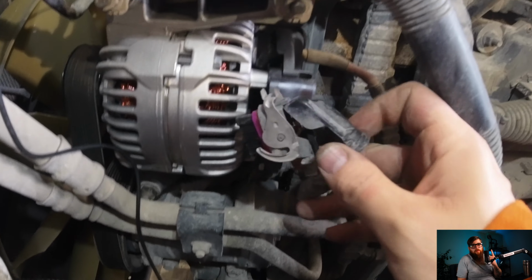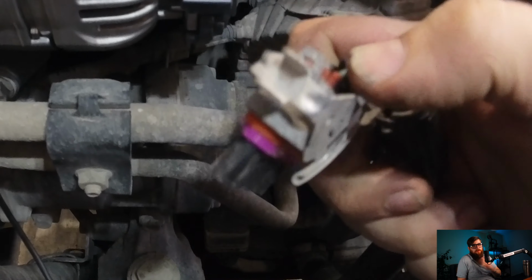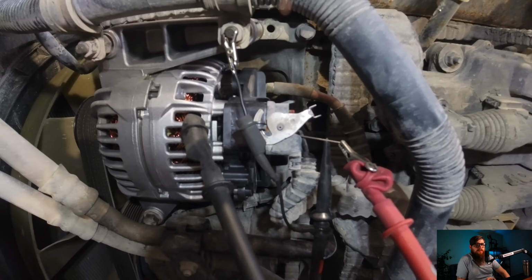As you can see, one wire. That's all this alternator needs. Turn on, turn off. Do I have a fault? LIN, which stands for Local Interconnect Network, is very similar to CAN, which stands for Controller Area Network, and as such complements each other well. In one hand you have CAN serving VECU to chassis module front with high speed, error sensitive needs and operating on a 5 volt bus, whereas you have LIN, which is low speed, low bandwidth, 12 volts single wire relaying information on when to turn the alternator charging on and off, for example.